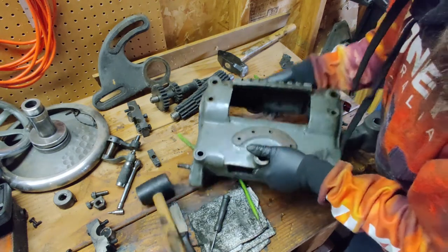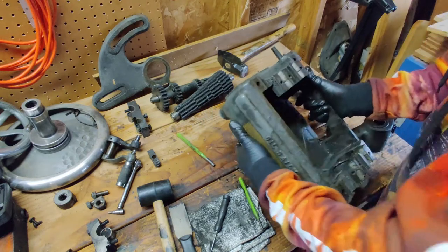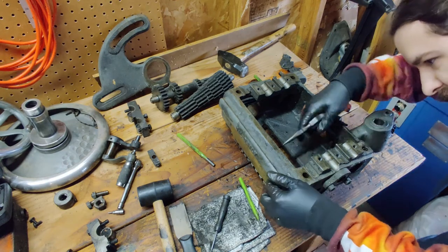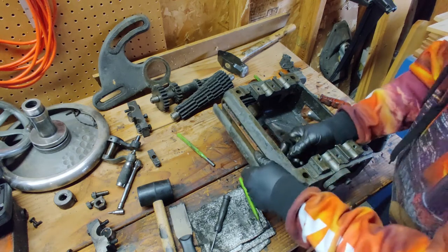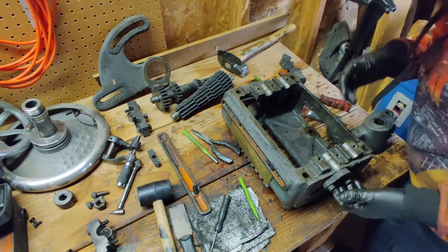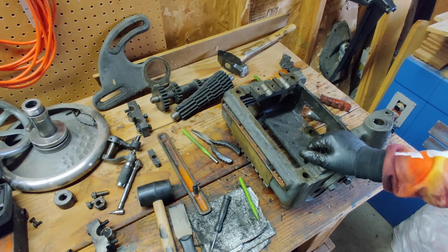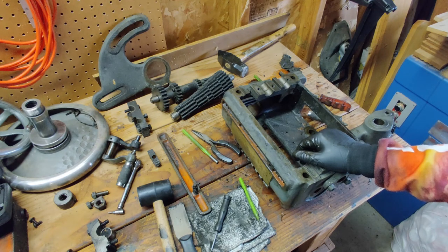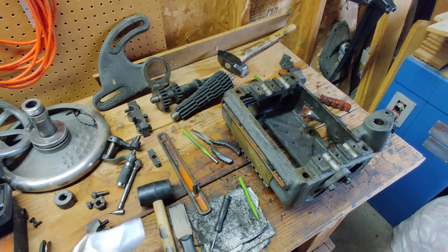So that looks like that's all we really needed to take apart on this. I'll probably pull that off, but not right now — it's going to take a little bit of effort. And we do have our oil cavity here — we can get just a small cotter pin and a spring holding that on. And that's really all of our disassembly. I've got a bushing here, but that's not really super important. I'm going to go ahead and get this all cleaned up, and that'll actually be it for all the components that can come off the machine. Next thing we have to do is really disassemble the headstock — we'll start there with getting the motors and its pulleys pulled off. And I guess we'll see that next. Thanks for watching.